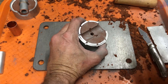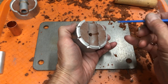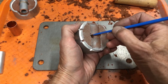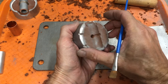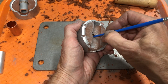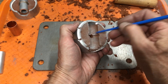At this point, without touching these two sides, you want to take the end of the paintbrush and round these edges — you want the metal to come in without having to hit an edge. When it hits an edge it'll slow it down, cause turbulence, or it could break the edge off and then you'll end up with porosity of some sort in your casting. So those edges need to be rounded.